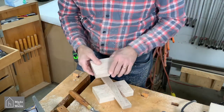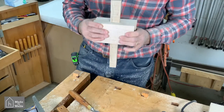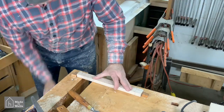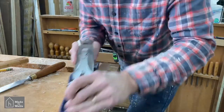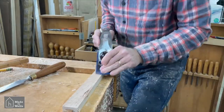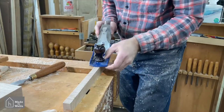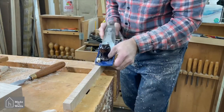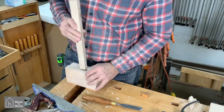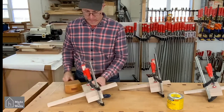The final fitting of handles into the heads before glue-up takes a little time — there's some give and take. As soon as you put the handle in, it's obvious if anything is wrong with the dado: whether the bottom isn't flat or the paired edges aren't square. Some back-and-forth chiseling and testing happens. I also did initial fitting of the handle so it sat far enough down into the dado and wasn't sticking out too much after first cutting.